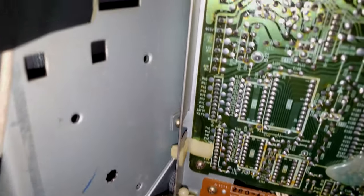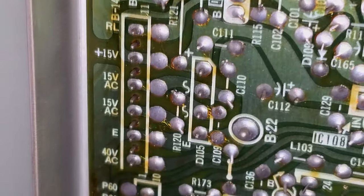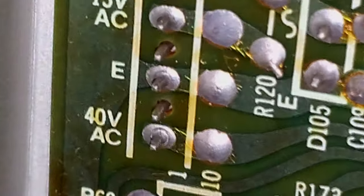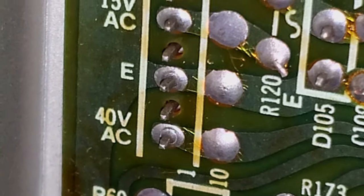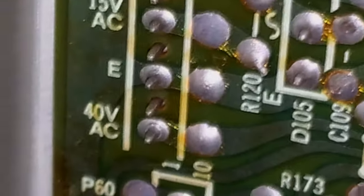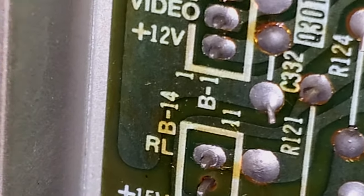What the red one connects to is up here, where you see all these voltage points coming in. I hope you can see — right down there on the 40 volt AC — we've got a clear point where the solder is just ready to almost break free. You see how it's got a ring around that point there. And even some of the other ones, like that top one too, also looks pretty dodgy.